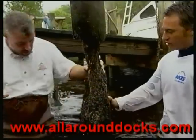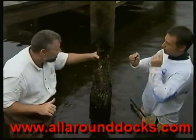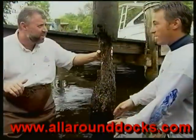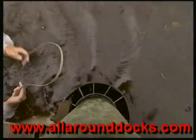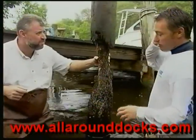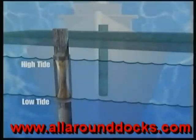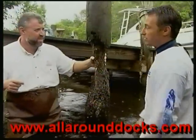How do we make the piling structurally sound once again? What we need to do to these pilings is obviously they have more damage — we need to come in and do a concrete system. What we'll do is use stainless steel nails to build a block around for a spacer, same around the bottom. Then we take the sleeve of plastic, put it over the piling, attach it with plastic straps, and nail the seam just like on the wraps. We're trying to get at least two inches of gap all the way around the piling. Then once we have the cylinder built and it's in the sand line, we'll pour dry concrete into the cylinder. That dry concrete will absorb the water it needs and force out whatever else it's not going to use.